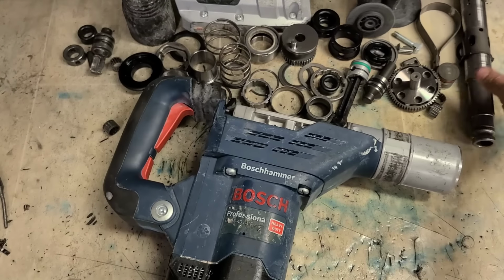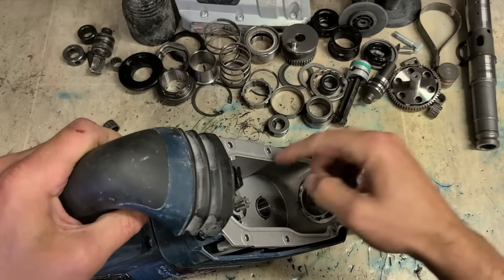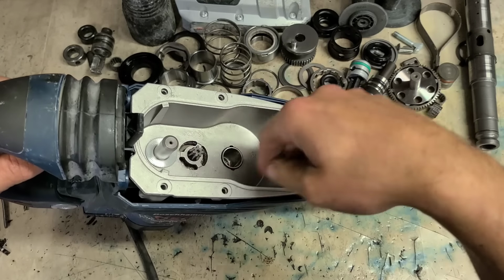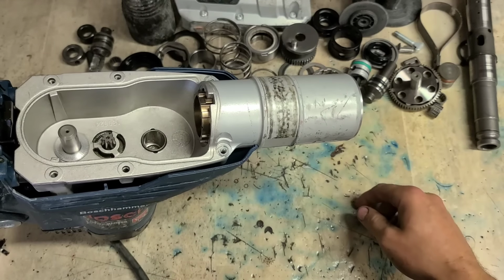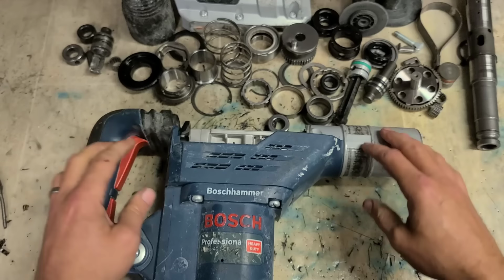Now, that just goes to show why it's so important to actually wash these things out. When a part breaks inside the hammer mechanism and smashes like that, you really do need to wash it out. And actually washing this out on the parts washer, with washing fluid washing through here, you can actually hear bits of debris dropping out of here, actually hitting the metal tray in the parts washer. You would assume the way she looks, it'll be alright to reuse that grease, but obviously not.